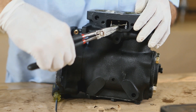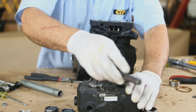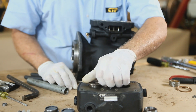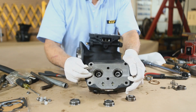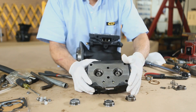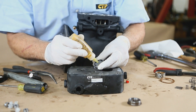Replace the valve assemblies in the compressor body and the valves in the cylinder head. Place the cylinder head on the bench deck side up and insert the valve removal tool into the inlet valve stop, then unscrew and remove the inlet valve stop. Remove the inlet valve spring. Reassemble with new parts included in the kit. Install the two valve retaining springs — a little bit of grease will keep these from falling out when turning the head assembly over.